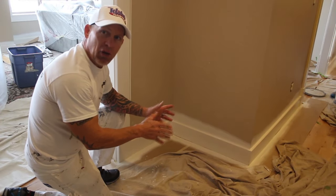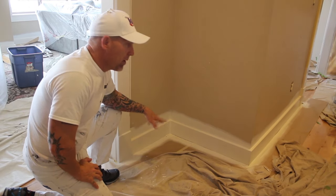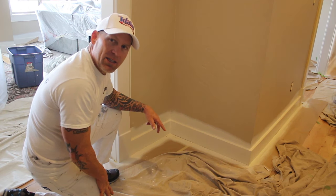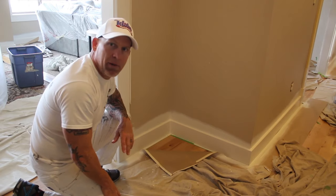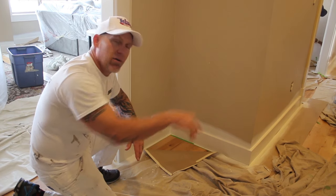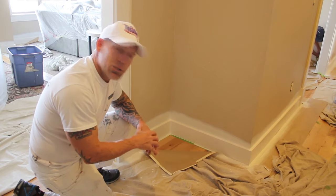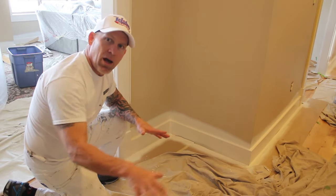We're in this house spraying the baseboards only and then rolling our walls — we're not painting the ceilings. We're running nine inch paper and one inch tape around to give us masking onto the floor so we don't get any overspray on it. We're putting frog tape down first — you can see right here — that's our nine inch paper, one inch 20-point tape, with frog tape around the edge. The frog tape protects the wood floor from paint bleed, and the nine inch paper gives us protection from overspray.